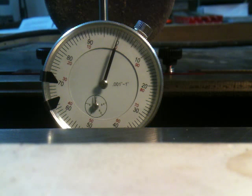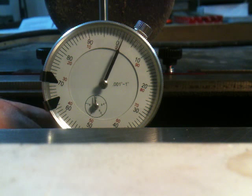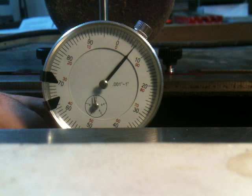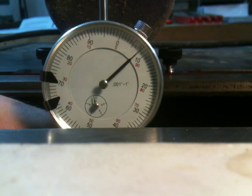I'm checking to see how much play I have in the arbor shaft. When I gently rock it, it goes up to two thousandths of an inch, and if I increase the pressure on it, I can go higher — actually much higher if I pull it really hard.